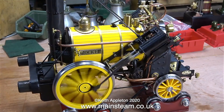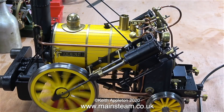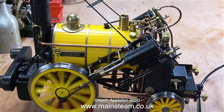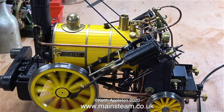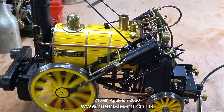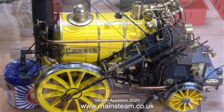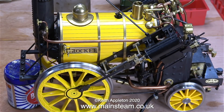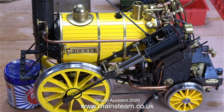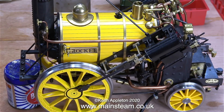Here's an extract from a video I made a while ago when I first bought this beautiful model from Simon Hudson at the Steam Workshop. I was puzzled by the thing at the front - all it is is a large cast iron weight. You fit this to the engine if you want to run it. The sole purpose of this cast iron weight, apart from having a couple of rudimentary buffers on the front, is to put weight over the front wheels so the very small locomotive is capable of pulling a person around a track.